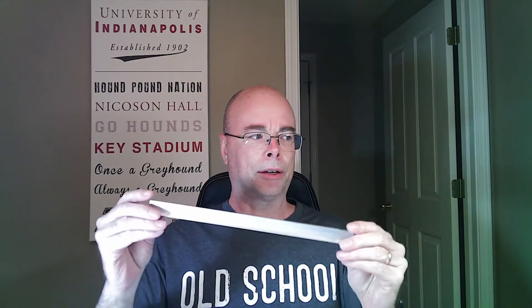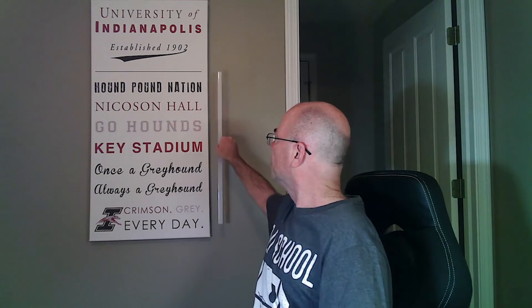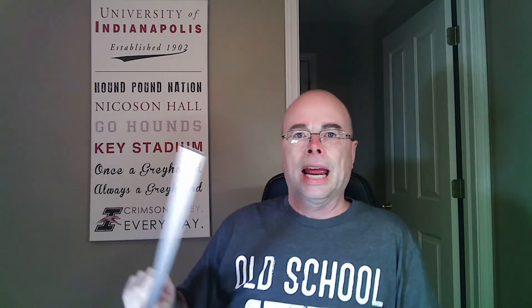There's one more thing I want to cover since I mentioned it at the beginning: if you'd rather create wall-mounted sound reactive LEDs instead of a floor lamp, we can use a little bit of aluminum channel, purchased online — I used it in my stair video. The advantage is it comes with a diffuser and mounting clips. Unlike the commercial version, you're not limited to just a 90-degree angle — you could put these at any angle and pretty much any length. You also have the full suite of WLED beyond sound reactive mode: hundreds of effects, solid colors, fading, anything WLED can do.